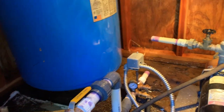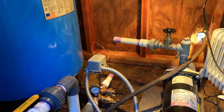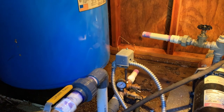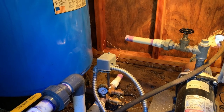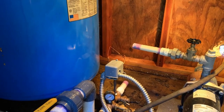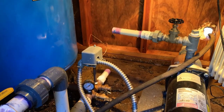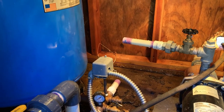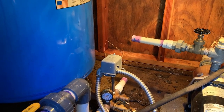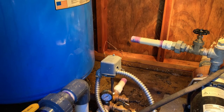I've come back to the pump house with my inspector, hoping to get a passing grade on the inspection, but we opened up the door and — we're in the same situation again. It's broken, it needs some more repair. It's broken there and there. Now I was boasting this morning about how warm it was, but it's actually only 46 degrees out, and I let it dry for an hour. But I reread the tin and it says cure time is two hours at 60 degrees. So maybe the problem is that this cement isn't curing, and that's why it's failing. 100 psi is a lot of force — that's a one inch diameter pipe, so half inch radius, so like 75 pounds of force.